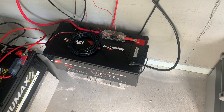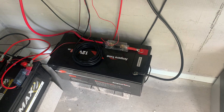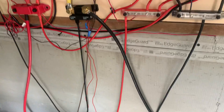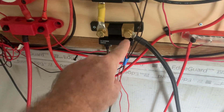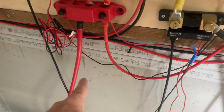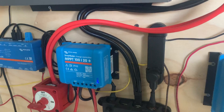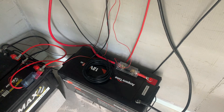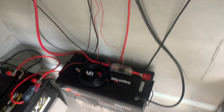I'm very pleased with the battery, but I wish I had gotten two 100 amp hour. If I went out and bought two more, I could put them all in parallel and have a really clean setup. As it is now, I'll have two parallel batteries feeding in here with one wire from the new ground and one from the new hot, and everything ties back into the system. This charger won't have to change because it's the same float voltage, same charge voltage, and same absorb, so it will treat both battery banks the same.